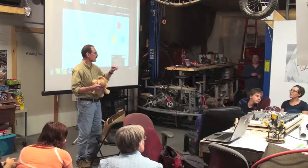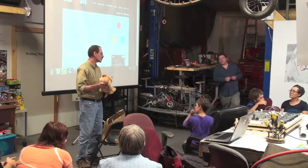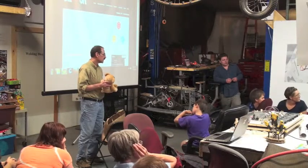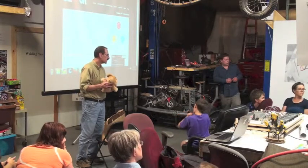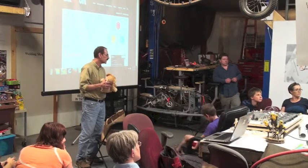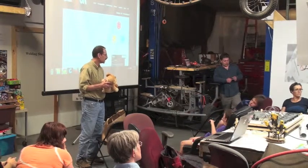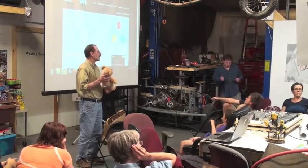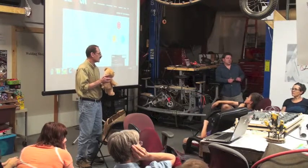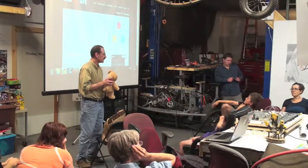Dollars, and I can find them less expensively, but they may be an earlier version. I don't know. So, Roving Networks got bought out by Microchip, but they make a Bluetooth audio module that's got a 2-watt built-in amp. You just hook up an 8-ohm speaker to it or whatever you want, and you're good to go. I think they're like, I want to say $10 or so.